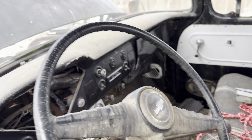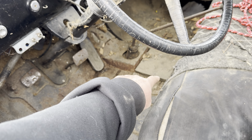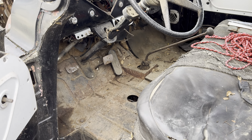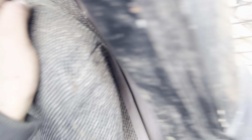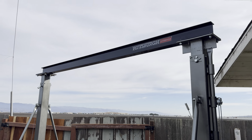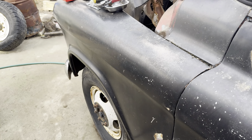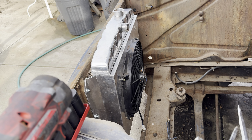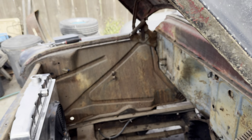Dashboard's over there. I want to take the steering column off, take that floor plate off, and take all that insulation stuff out. I've also got to take this insulation out and then the fuel tank. I've got my cab puller, I still need to get a couple things for it — including the hoist and the little part that goes across the beam that holds the hoist. Getting ready to pull this cab off.